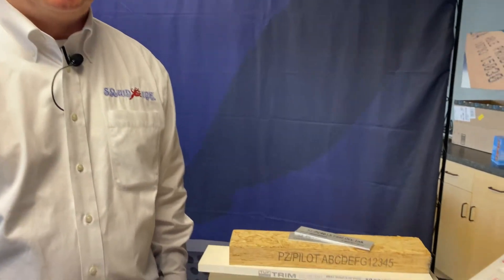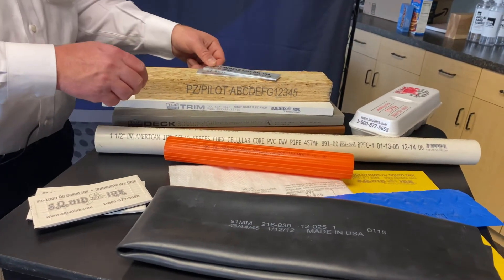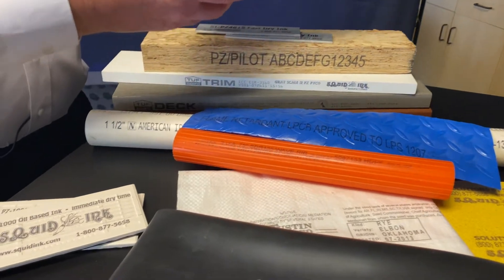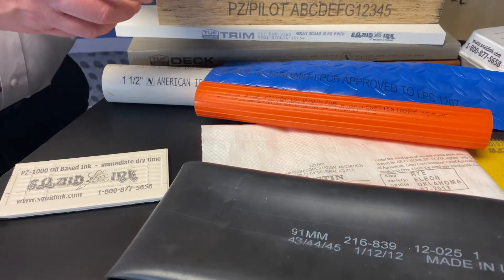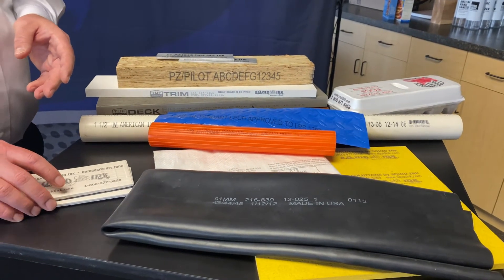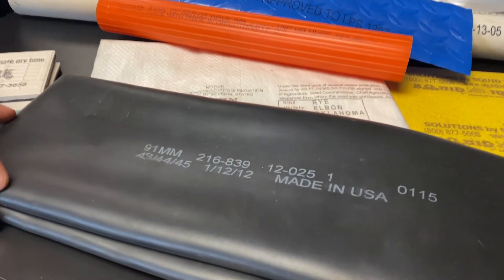The Co-Pilot printer can handle a variety of different inks for printing on different substrates. In our demonstration we're using oil-based ink on the box, but we also have solvent-based ink for non-porous products like metal, foam, or rubber. We also have UV curable inks for instant dry time with the addition of a UV light to cure the ink after it's gone past the light source, and we have that in black, red, blue, green, as well as white. Lots of variety of ink for your application.